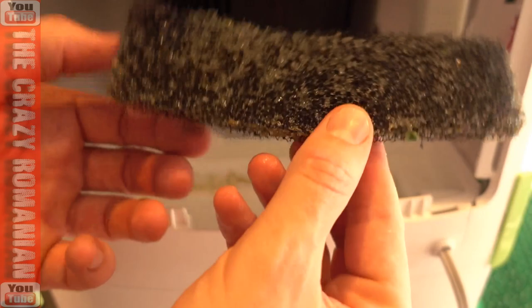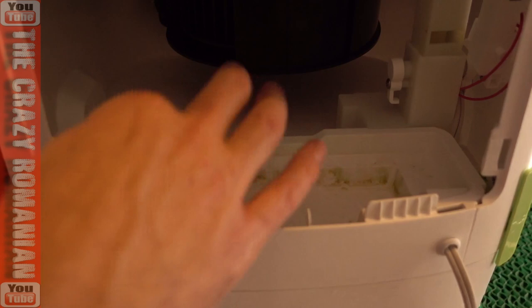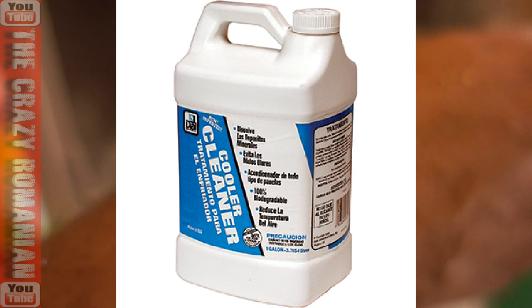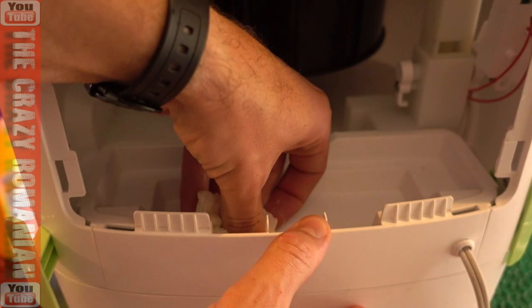There's a little filter that you can wash in your sink. And you see these little deposits over here? This needs a little rinsing with soap and water — same as before, just take a paper towel and you'll be able to rinse this stuff off. Don't be scared about this type of maintenance — this is nothing, and you only have to do it maybe once a season. There are chemicals you could put in here to kill the bacteria, but I don't like chemicals going through my house. I prefer to do this by hand — it doesn't cost anything and it will keep the entire unit better and give you health benefits.